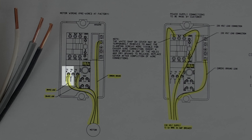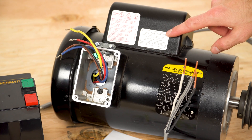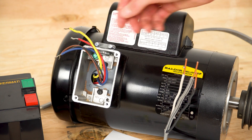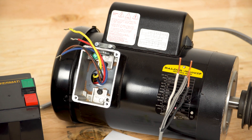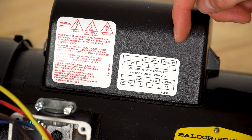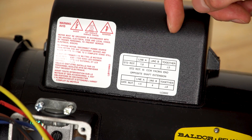I'll connect the white wire to T1, the black wire to T3, and green or ground goes on the right side up here. Once the switch is wired, we're ready to tie into the motor. The motor wiring diagram is located on the motor itself. This motor has five wires — some have even more. Because we have more wires on the motor than in our power cord, the diagram points out which wires tie together. It's labeled as Line A, Line B, and Together. Line A is usually your hot or black line, Line B would be neutral or white, and Together simply means we'll tie those wires together.